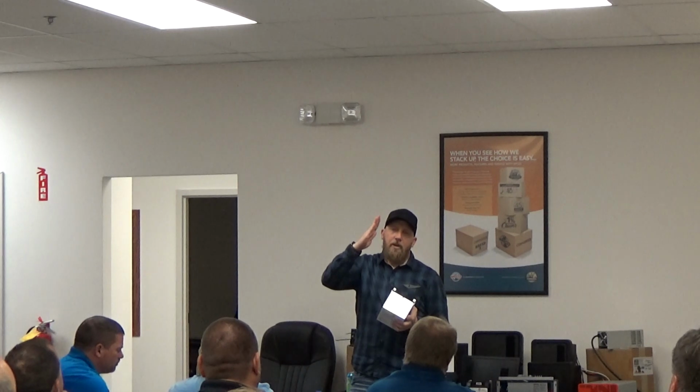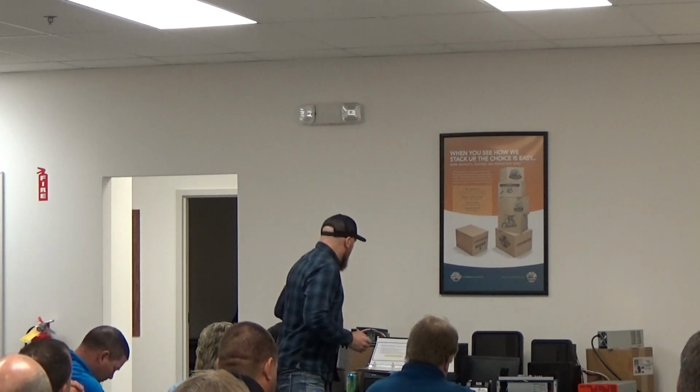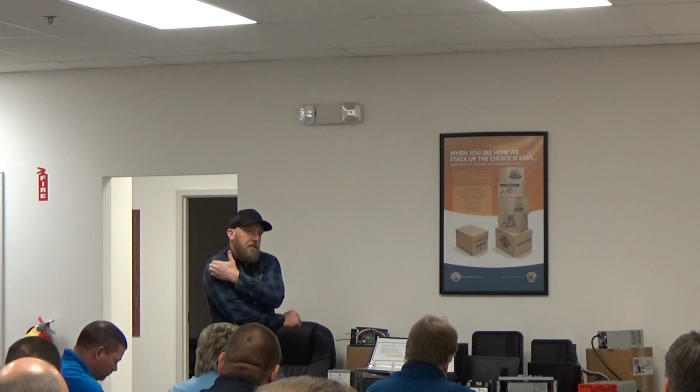So there's like a little sled in here, so when you're on shore power, it's up. When you're on generator, it goes down. So it's really just making a connection through a timing board. So once it receives the 30 seconds on the generator, the relay will go down and it'll pass through that voltage. There's not really a whole lot to talk about with transfer switches. It's just a time delay.